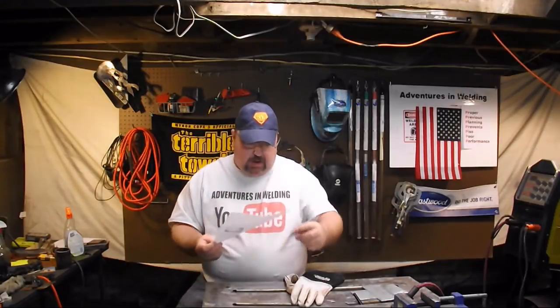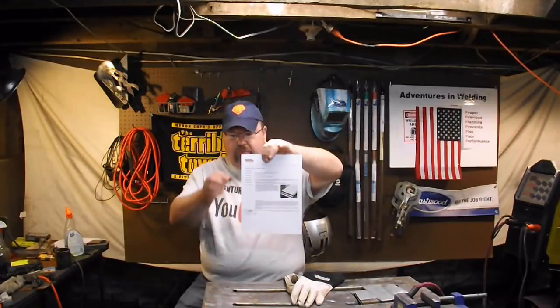The answers are really simple. I've got a cheat sheet here — 'Preventing Cracking in Aluminum Welds' — from Lincoln Electric. It tells us you get crater cracks for three reasons: First, aluminum has a high thermal rate of conductivity — aluminum sucks up heat, that's why it takes significantly more heat to weld an equal thickness piece of aluminum than it does mild steel. Second, the relatively large change in volume when aluminum solidifies — when that liquid aluminum solidifies, the volume changes, it contracts, so you need to add more filler than you think. And finally, the third thing is the concave shape of the crater.